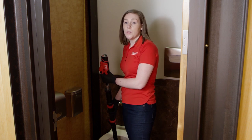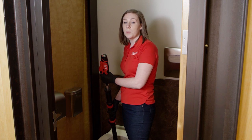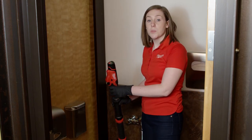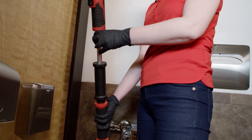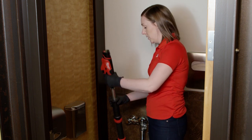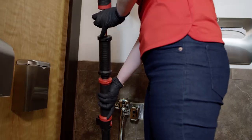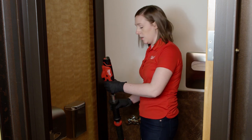The Milwaukee solution is unique because we have the first solution with a locking mechanism that locks the cable in place, which makes it that much easier to telescope the remaining three feet of cable inside the auger. To do this, pull up on the handle to find the red line. Once you've found that red line, position it just below the black handle and then push down to lock your cable in place. That ensures the cable is not going anywhere while you telescope the remaining three feet.